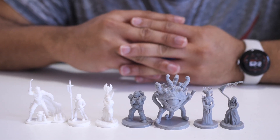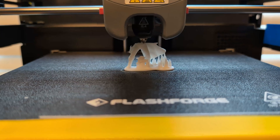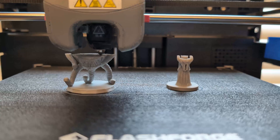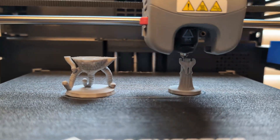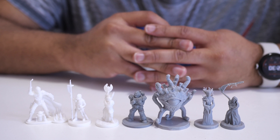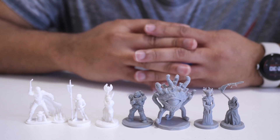Let me just show you some of these models from this side, and I'll move over to the gray. I printed all of these with a layer height of 0.08 and a first layer height of 0.16. 0.08 is the lowest that you can go, recommended at least, with the 0.4 millimeter nozzle that comes standard, but if you have the smaller 0.25 millimeter nozzle, you'll be able to print at a lower layer height, and thus get better detail at the cost of a longer print time.